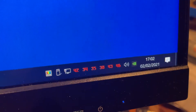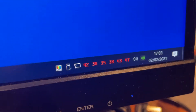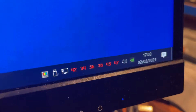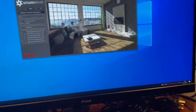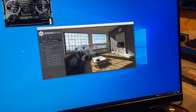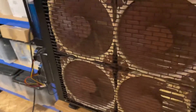Back over here — 75% power limit, everything's starting to heat up now. Windows will never show all these GPUs in their true allocation order, but we can see from the temps that because it's in series the liquid temp gets hotter as it passes each GPU. We can assume it starts really nicely in the mid 30s and gets up to — at the moment the highest is 48°C — so it'll get a bit higher but not much more.